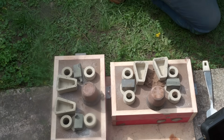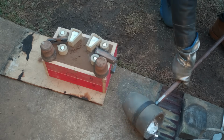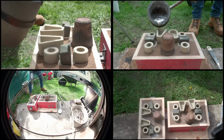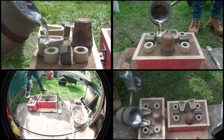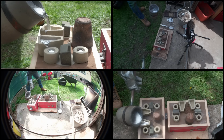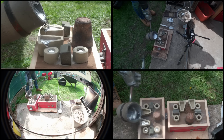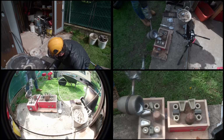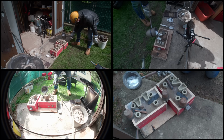Okay, let's go. Now, while I only need 3 good pistons, I've been through a number of iterations trying to sort out my technique, and most of those sessions involved multiple castings, so you can see I got lots of different angles. The game's not about filling the mold as fast as you can, but really you want a nice controlled flow of metal that's not too turbulent. So the pouring basins are matched to the sprues to hopefully give a nice low turbulence fill.